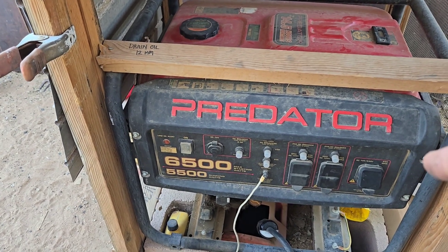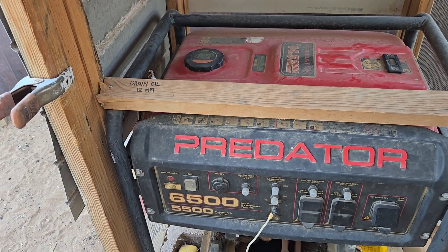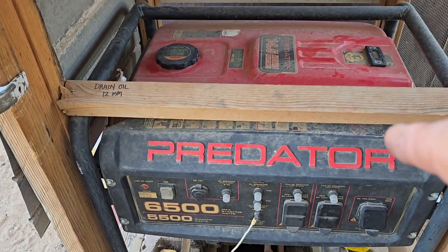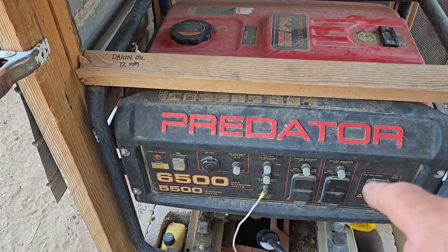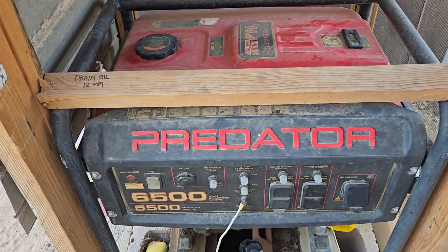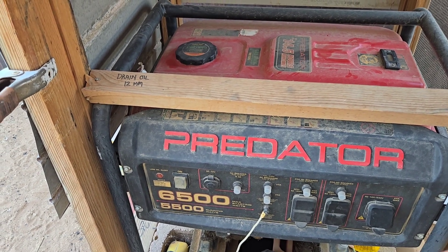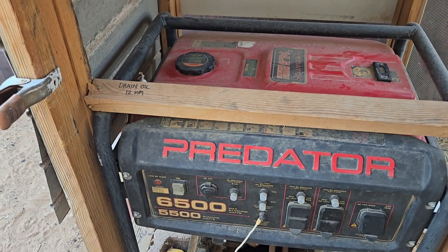You're going to have to maintain that battery. They do now make starter batteries in LiFePO4 — Watt Cycle has them and it's called the Ultra. If you're going to get one of those, remember there's got to be a way of charging that battery, because the generator itself doesn't usually recharge it — it just lets the battery start the engine, then the generator powers your electricity, but it doesn't recharge the starter battery. Make sure if you're buying one that it has a built-in 12-volt charger, like your car engine does, so it recharges the starter battery after you use it.